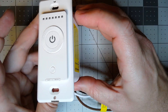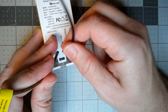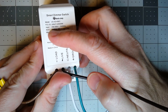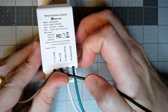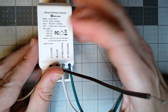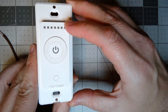That way you don't have to go turn the breaker on and off. So wiring this — which we'll get to when we wire it in the wall — there's the ground. Yes, you will need neutral because it is a smart switch. And there's your live or your input, and then there's your load that goes to the bulbs itself. It does support 100 to 240 volts, 50 to 60 hertz, as well as 150 watts LED and 150 CFL. Most everyone's probably going to be using LED now. This is the Decora size, so we'll get this installed and check it out.